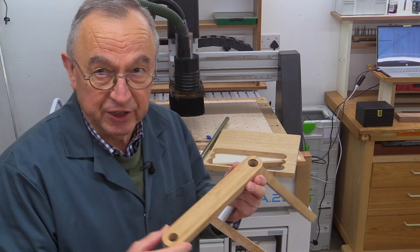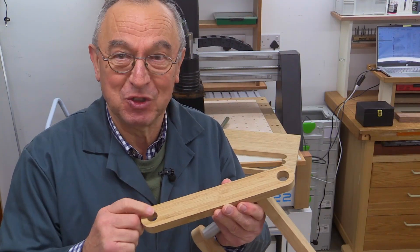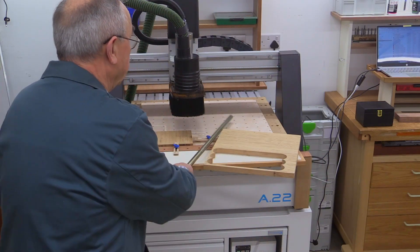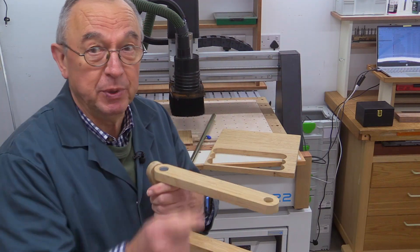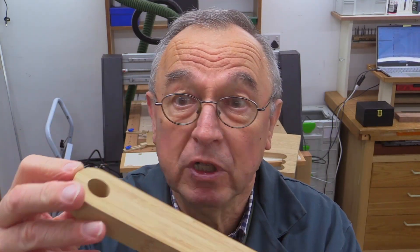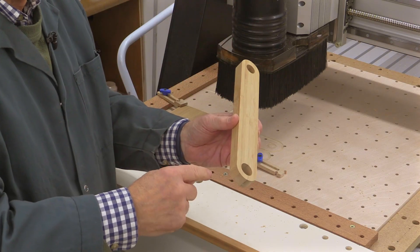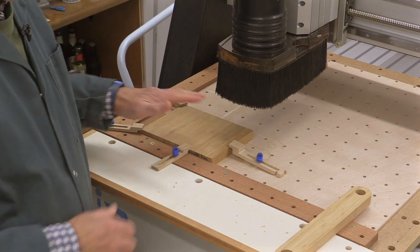I've just finished cutting out these simple bits — these are the long arms, three of them altogether. The only thing to remember is that one hole is smaller than the other. The larger hole is because at this end we've got a piece of tubing through which the long piece — that allows this to go up and down — will fit, whereas at the other end there's a short piece of thinner tubing. I'm using bamboo for this; it just happens I had some left over and it's very strong. I'm now getting ready to do the short pieces that fit between the long bits. The top and bottom ones just have a rebate rather than a hole, but the in-between pair have a hole going through.